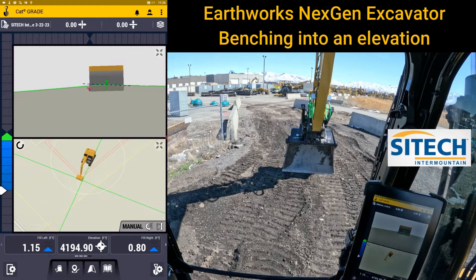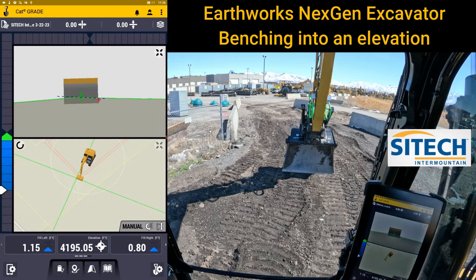On the main Earthworks screen you can see that I've got elevation set at the bottom right. In here you don't want to use design elevation — you want it on just true elevation. If you use design elevation you're going to go wrong. You also want to make sure the carrot on the left side, meaning the red dot, is on the side that you're actually going to set down on for the elevation, because it changes based on that.